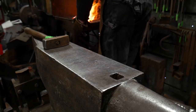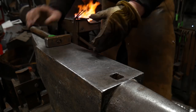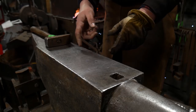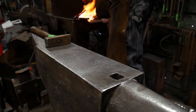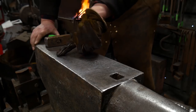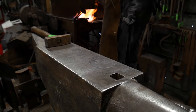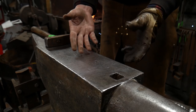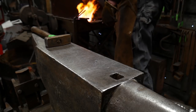All the different types of scrolls, finial ends, and things of that nature can be grouped together and done in all sorts of different scroll work. It's important to remember: if you've got a scroll going to the right but then one going to the left, you're going to have to make your impressions on opposite sides. The reason being, you might find that you made all the scrolls you want but they're all right-handed, so when you flip it all the detail is on the wrong side. Think about which way this needs to scroll and orient your impressions accordingly.